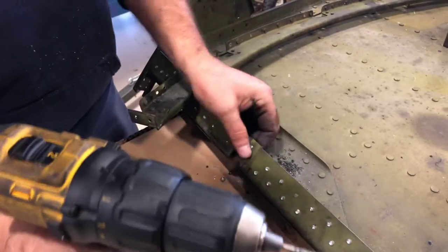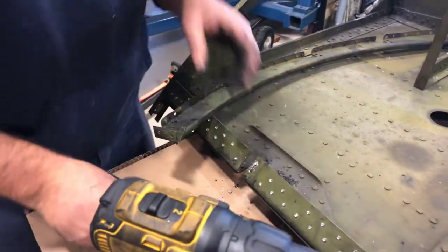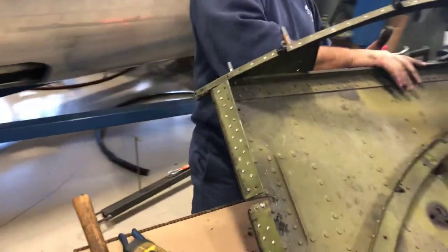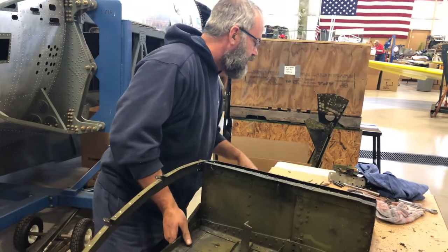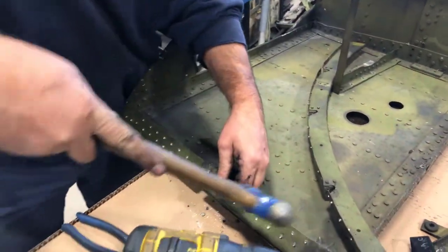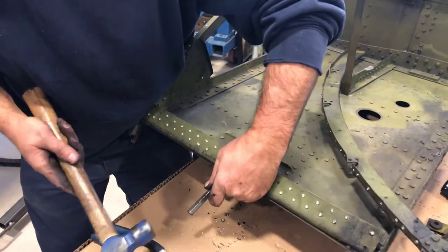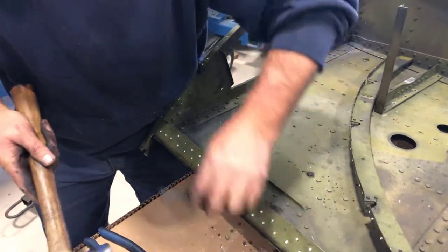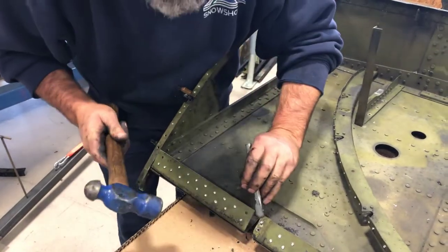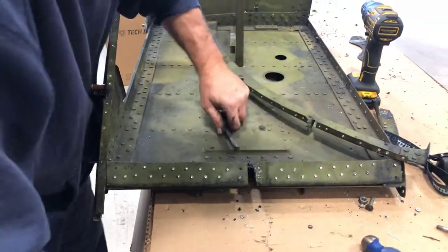The idea is not to make the hole any bigger. That one just popped out. This one is a little taller, so what we'll do there is find my chisel. We're going to shear it off on all four sides so it pushes the rivet back into the hole. This one is particularly hard for some reason — we're going to drill it out a little bit more.